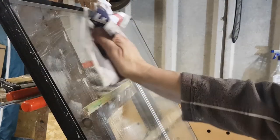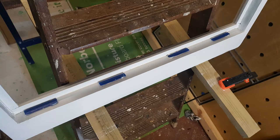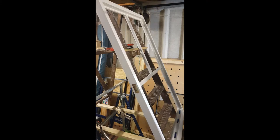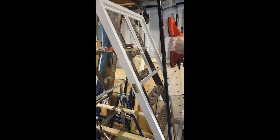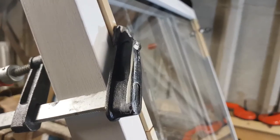The glass needs to be cleaned thoroughly — it's very difficult to give glass a good clean because you can see every imperfection. I like to use newspaper to wipe it off; I find it's the best material for this job. The spacers we looked at earlier are now glued in place to make sure the glass sits free from the wood. I've added a bead of silicone sealant around the inside of the frame and am now carefully placing the glass onto the spacers. Apply firm pressure and then add some clamps to hold them overnight while the silicone cures.